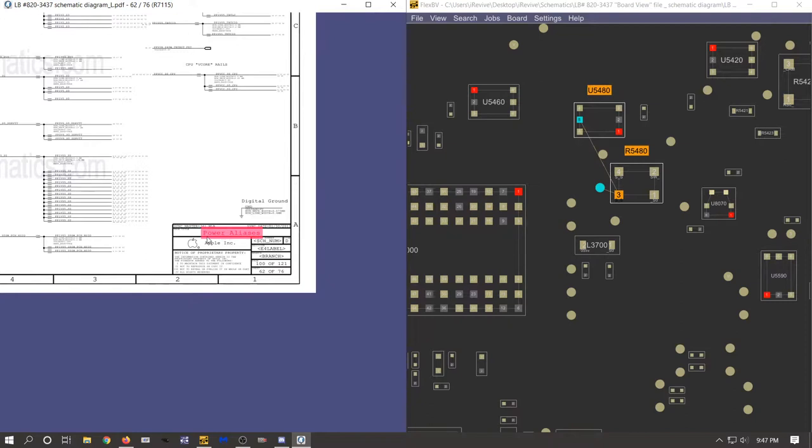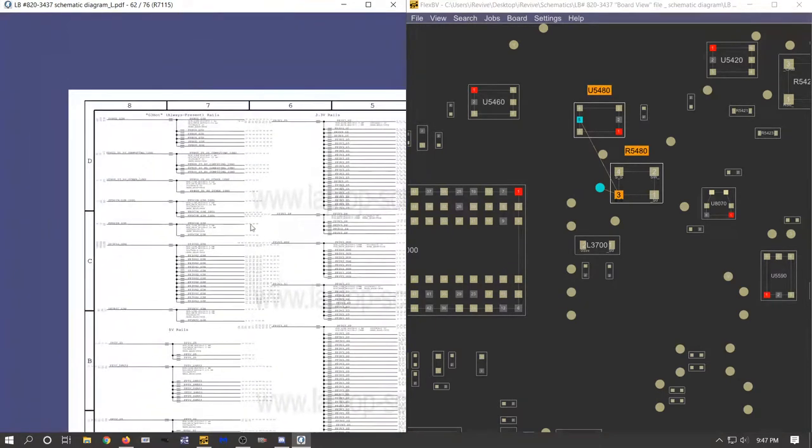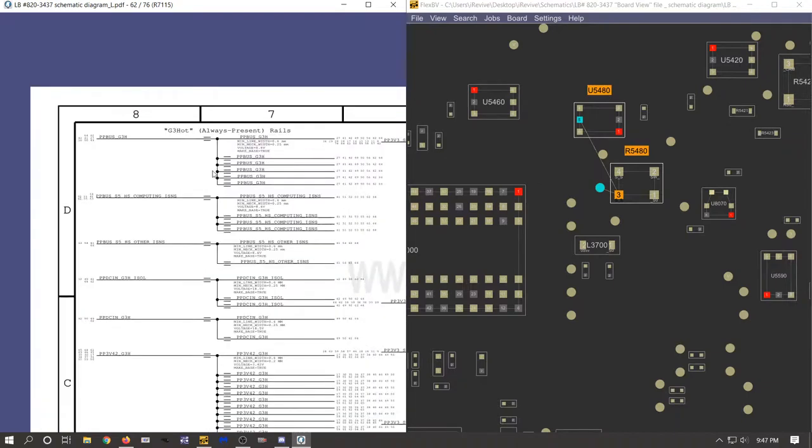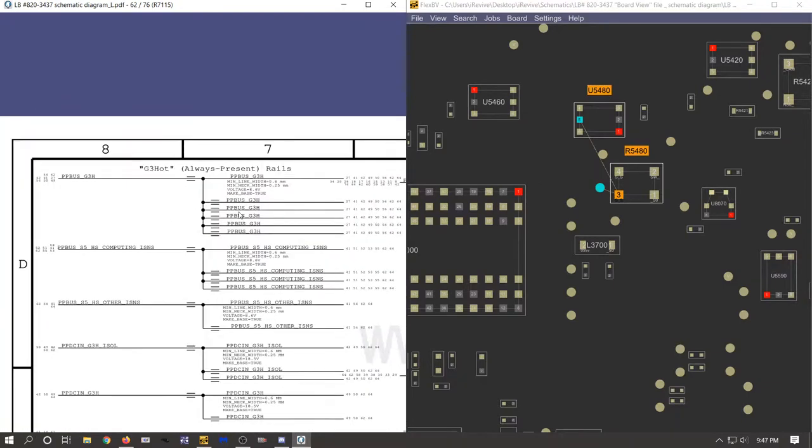Okay. And resistance for, oh yeah, let me tell you, I had a very sad experience with a MacBook Pro 15-inch. It didn't take long to diagnose, but it definitely had a bad CPU phase MOSFET that sent a PP bus straight to the CPU and killed it.